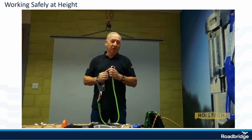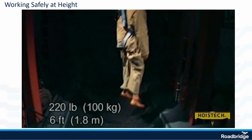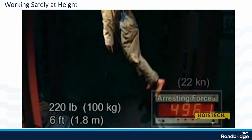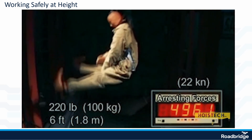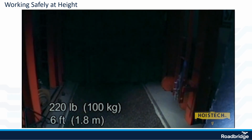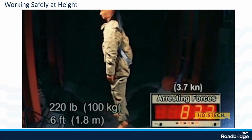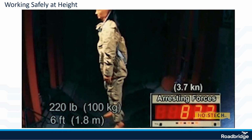Please see the next video on the importance of selecting the correct PPE. In this demonstration, we dropped a 220-pound mannequin only 6 feet. When the mannequin hits the bottom of its 6-foot drop, you can see the violent forces at work. Now, look at the difference when you incorporate a shock-absorbing lanyard. The forces on your body have dropped from almost 5,000 pounds to less than 900.